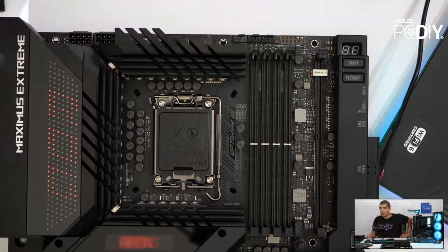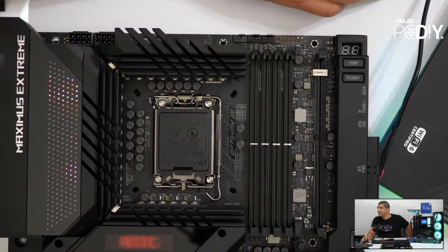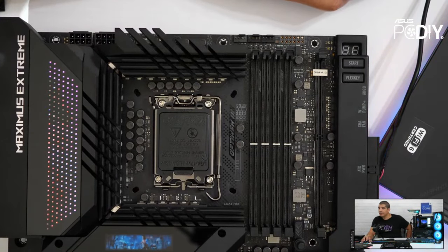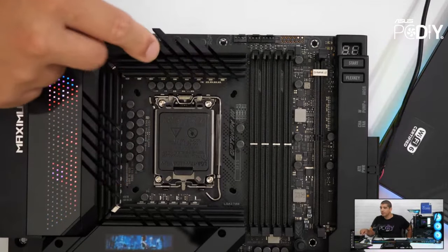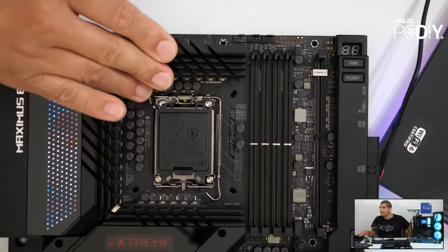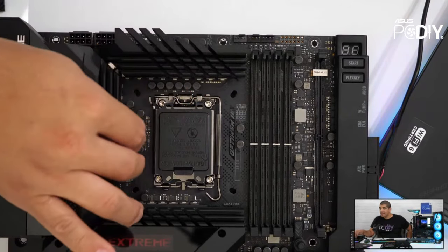So in terms of the overall stability of this VRM, whether it's stock or going to be overclocked, you 100% don't have to worry. This board is going to be super cool, super reliable in that respect. Very performant VRM design, as well as a very performant thermal solution. In terms of the overall power configuration, this is going to be a 24 plus 1, 105 amp power stages. It also has microfine alloy chokes and 10K rated capacitors.